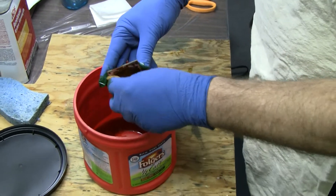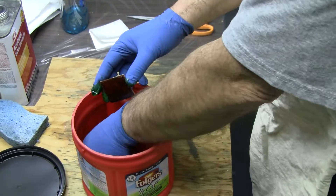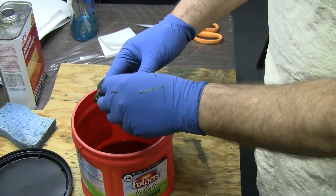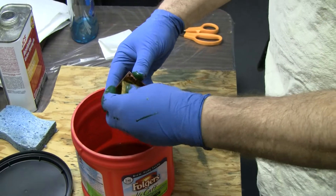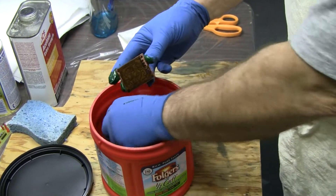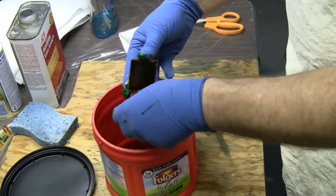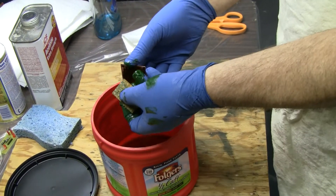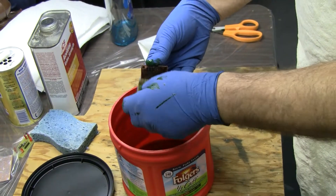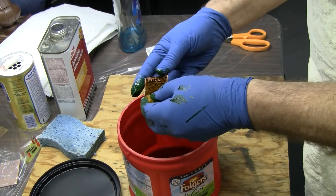You just wipe, keep wiping it. Now, a way that you see a lot of times is people just put it in a vat, a tray of etchant. When you do that, it will create the solution, and you use a lot of the etchant. The other thing is it tends to clear from the outside edge to the center. When you use the sponge method — see how I'm getting green stuff all over me — it is a little messy, but it'll actually clear in the middle first and then clear towards the outer edge.